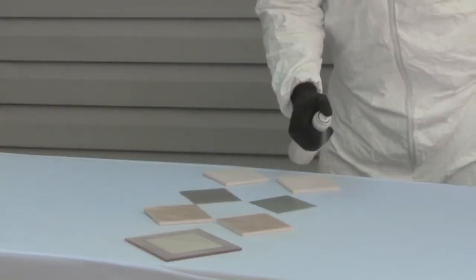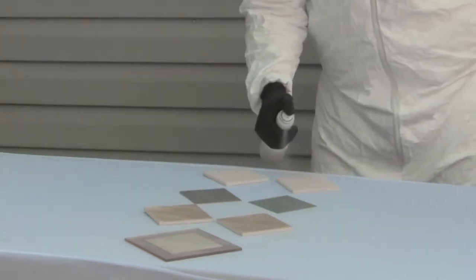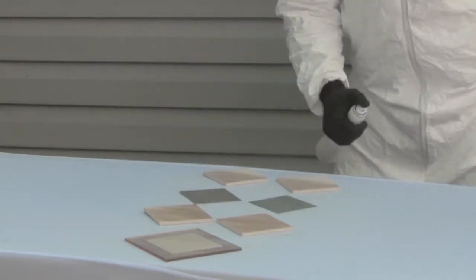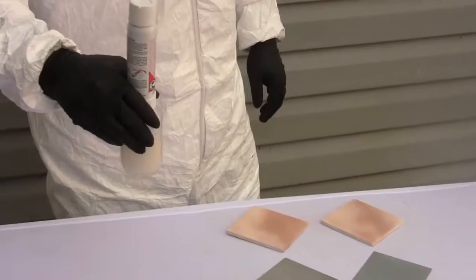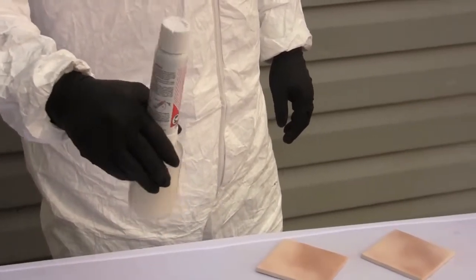Start by spraying outside of the substrate if possible, and slowly coat the substrate in thin, uniform passes, moving the sprayer at a constant speed and a constant angle throughout the coating process. Overlap each pass slightly in order to ensure that there are no edge defects at the outside spray boundaries. Swirling in between passes will help keep the Ultra EverDry thoroughly mixed.